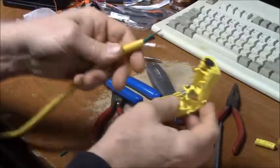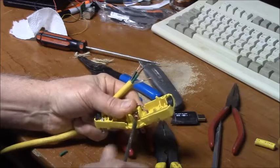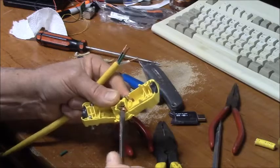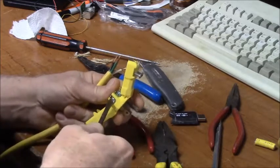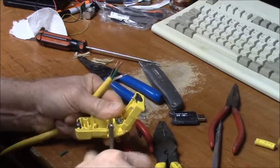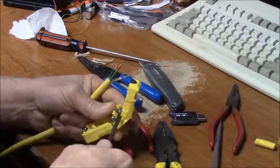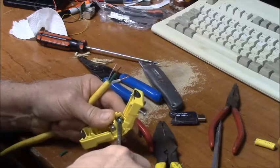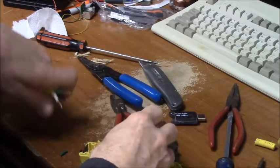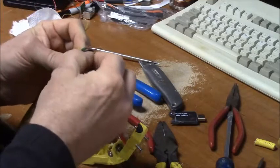All right, so this was lucky. There's no clamps to worry about. We just loosen these clamps up, and you can see on the inside it comes apart, comes open. So we want to open these all up. If you're using nicely stranded wire, you want to make sure your strands are all twisted together tight. Now if you saw me make the generator extension cord, I called this doing the little dance. You kind of got to bend these guys inward.